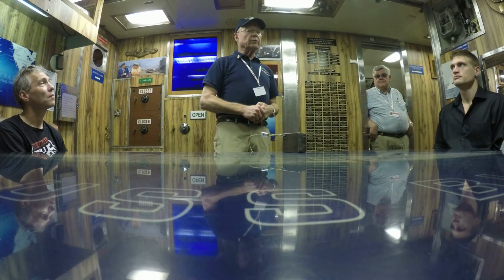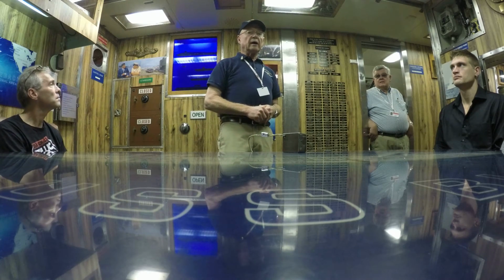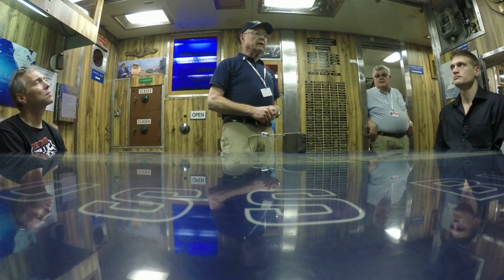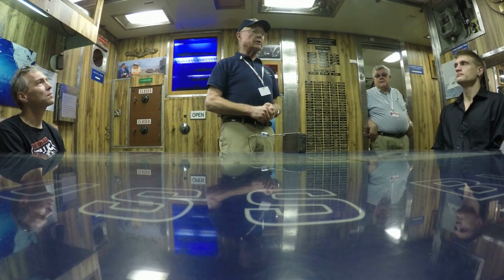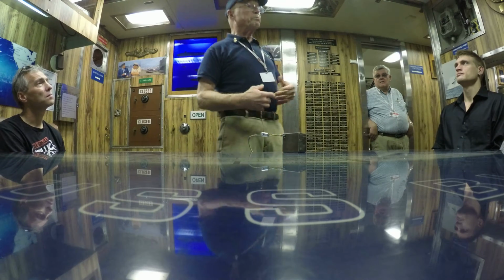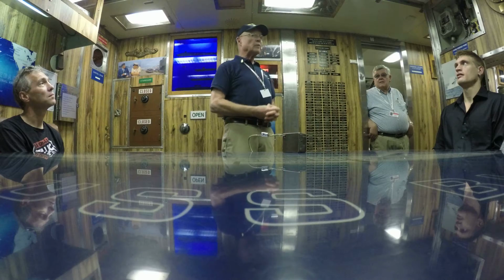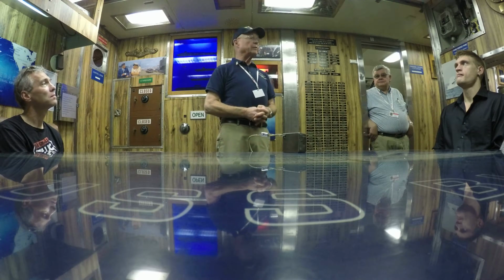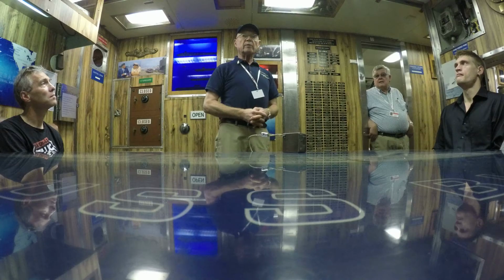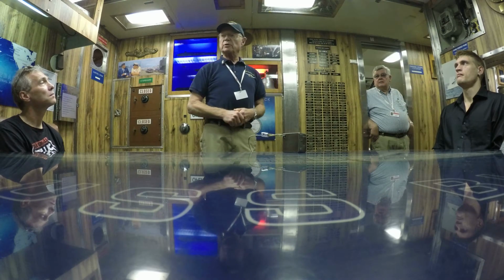which was fine until the Thresher, SSN 593, was undergoing sea trials off the coast of Virginia in 1963, and she got down and a main seawater inlet to the primary coolant for the reactor burst, and 3,000 pounds per square inch wasn't enough to bring that boat back up to the surface, and everybody died, and the boat is still down there. So the Navy instituted a program called SubSafe, and every submarine that was alive then has been backfitted, and the ones that have been built since then have been built with a system called SubSafe.